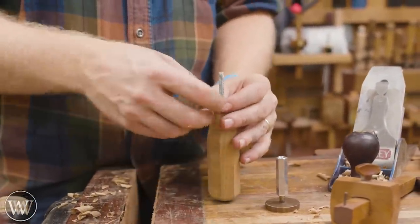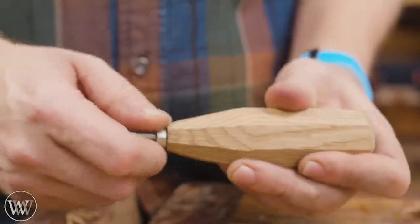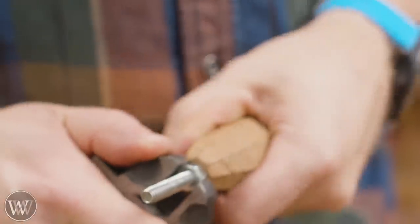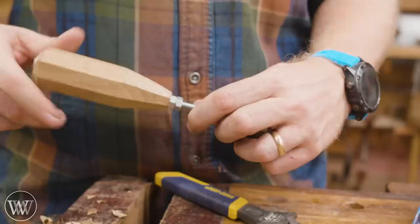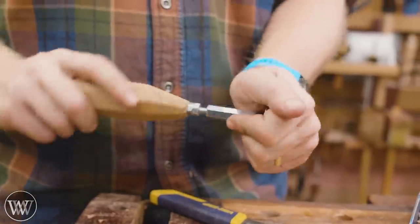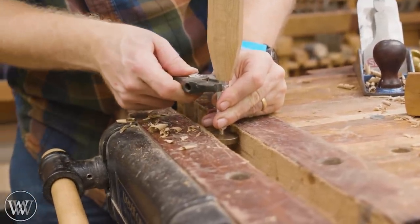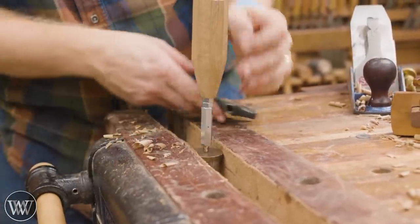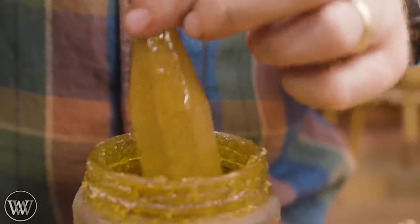Now we're ready to assemble it. Put in a washer and then two nuts — we want to lock the two nuts against each other. In the end I decided not to put the washer on there, as it stuck out a little bit past the flanges. So we're going to have the hexagon nut against the octagonal handle — it looks a little weird, but hey, it's a shop tool. We can then thread that onto the union nut we had earlier.